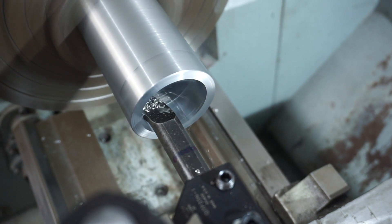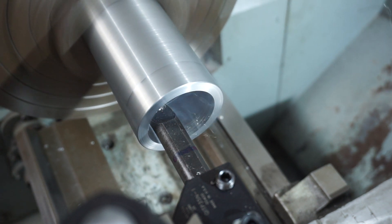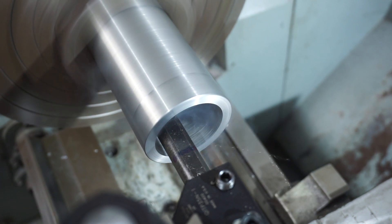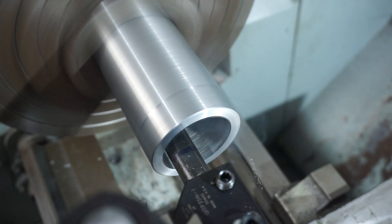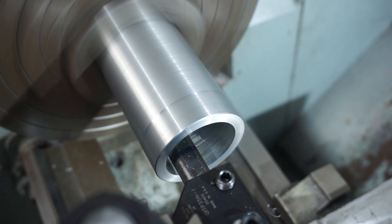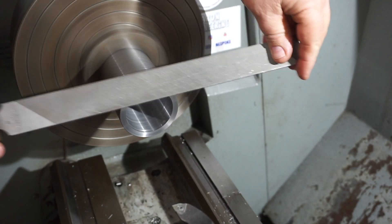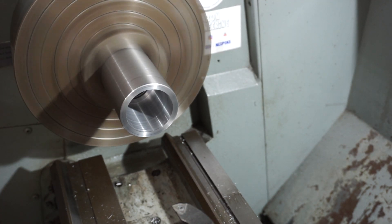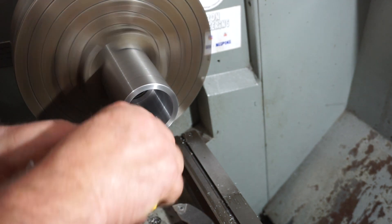What I'm doing now is expanding that diameter to fit my Colchester tailstock. It's rather big — it's 50.8mm, which I believe is 2 inches. I'm just boring that out and I had to take a whisker cut in the end just to get it to fit. Here I'm just breaking that sharp edge with my lathe file and popping in the deburring tool to break the internal edge. I knock the lathe out of gear and as it's slowing down just hit it with that tool.